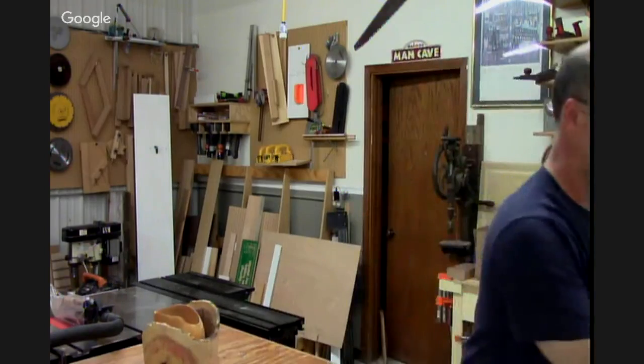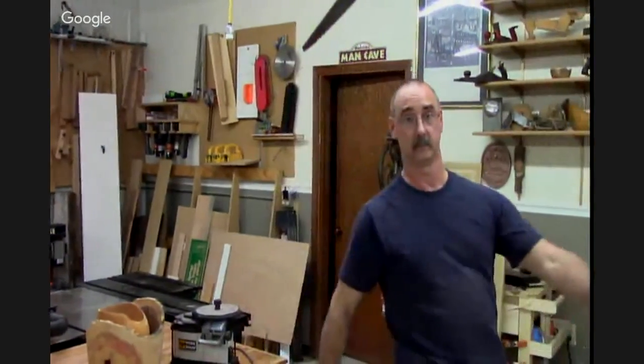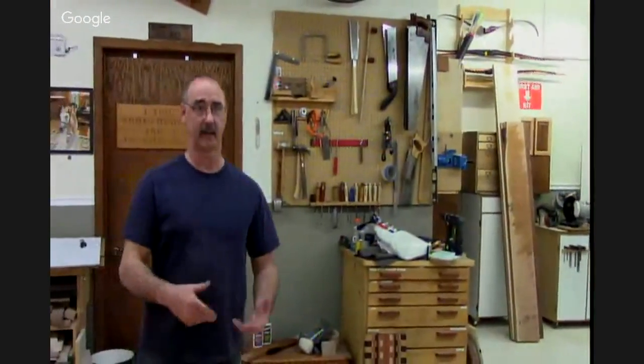George, is there a good finish for things like kitchen tables? We've got a lot of questions like that coming in. If it's a high-use thing, I'm a big fan of lacquer on a lot of furniture, but for stuff like tables, you can't beat polyurethane. High water resistance, high alcohol resistance, some heat resistance, so it's good if you're plasticizing the surface.